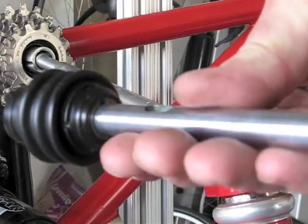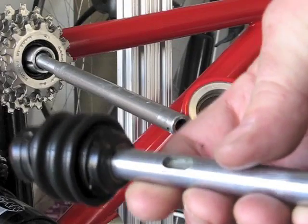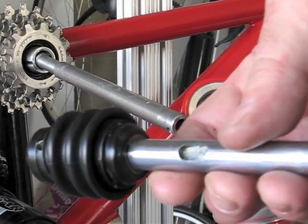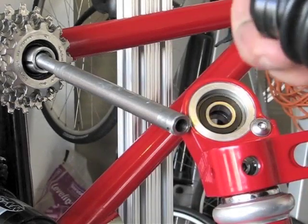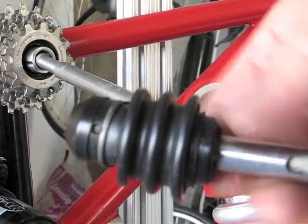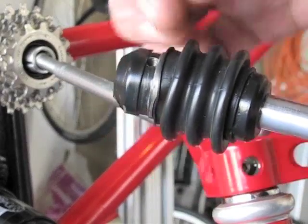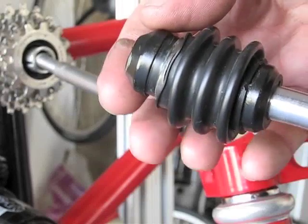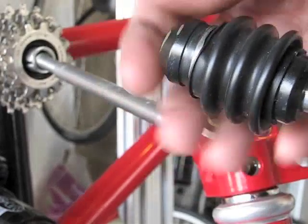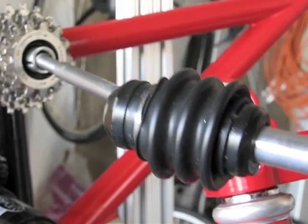This is the right-side axle for the wheel. I had it machined for a keyway because it is front wheel drive, so you need some sort of locking mechanism to drive the front wheel. I have a U-joint in here which I bought online, and there's a rubber boot with grease — it has needle bearings in there so I'm trying to keep the grease in. I machined it down quite a bit because it would have been much larger otherwise.